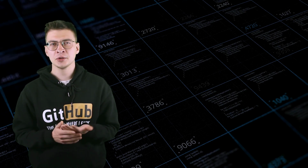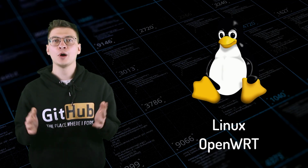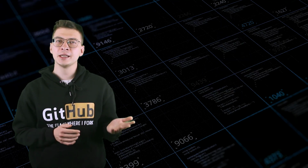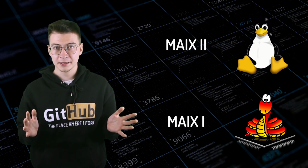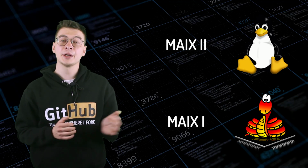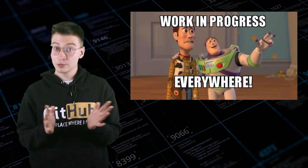well, hardware is just plastic and silicon without software to make use of it. How is the situation on that front for MAIX-II? MAIX-II is meant to offer a relatively beginner-friendly Linux firmware based on OpenWRT, adapted for edge computing. Users can enjoy a more complete development environment and abundant software resources under Linux, unlike K210, which only could run MicroPython firmware or C++ compiled user code. As of now, since MAIX-II is brand new, the software environment is pretty much work in progress.